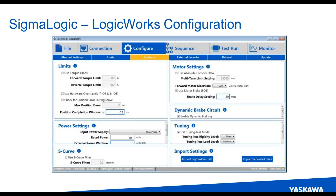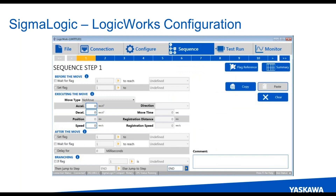The next tab at the top is the sequence tab. This is a cool feature in that this amplifier can actually also be used as a standard indexer. The commands are initiated and available within RSLogix; however, the events to start the sequence can be tied to physical IO or other events, rather than doing all of the sequencing over Ethernet IP. A good example here would be a rotary table where you needed high performance and the ability to customize the index moves, but the sequence repeated and you wanted to do it as fast as possible. This sequence table allows you to string a sequence of events and moves together and then trigger them from real-world IO, so you get away from any latency you'd have on an Ethernet IP network.